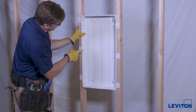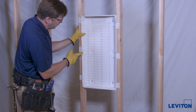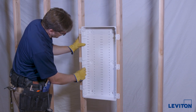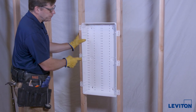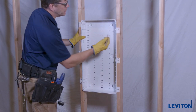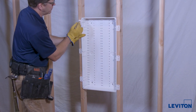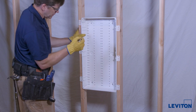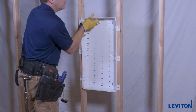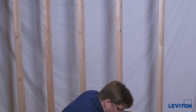There are center points you can locate on all the enclosures depending on which model. In this case the hinges are the center — not the tab, but the hinge itself — so we're going to put that hinge right on our mark. The easiest way to install this is to use the keyholes here. There's a keyhole tab here and here. These keyholes are where you can put in a screw and then just drop it on, which makes the installation much simpler. I'll go ahead and mark this one, take it away, and put a screw in that spot.